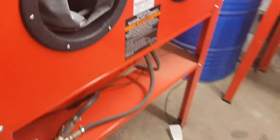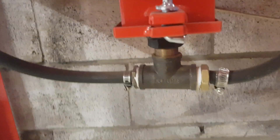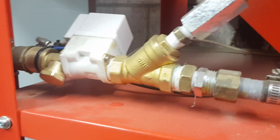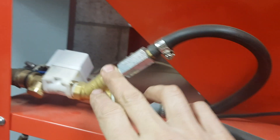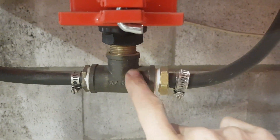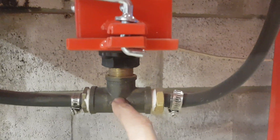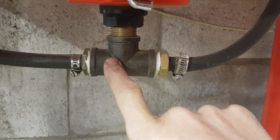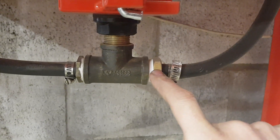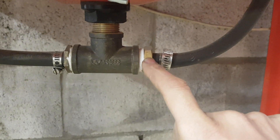Just a bit of an update. I was asked again about building these — I'm kind of running out of time so I can't really pull it all apart, but I'll explain it one more time. This side here is where the air comes in — you can see it tees off from the main feed. This is just the cheap solenoid. This one here runs up to the gun — that's the air feed for the gun. The other one comes through this valve here, so you can meter the amount of air going in to blow through, and then that comes straight down here. Down into this tee piece. My gravity feed comes out of the hopper, down into the tee piece, and settles around here. Now inside this — if you go have a look at my DIY vapor blaster gun video — this is pretty much just the same thing, but instead of having one of those pink ceramic tips in a fitting here, this just goes straight back to another brass hose barbed fitting.